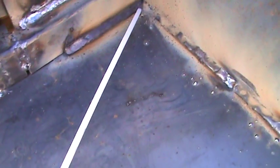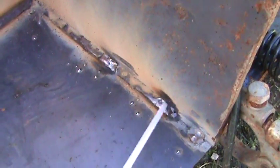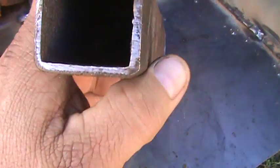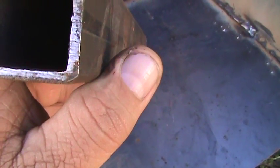As you can see, I've got a tack weld here, a little weld over here — back and forth. That's because you do not want to start on one end and just weld straight through, because you're going to warp the plate. So I clean the weld up, let it cool, come back and tie in, let that cool, jump around. I'm staying up on the high side, making it tie in, because I'm using square tubing. As you look at the end of this, I'm welding to this piece where my thumb's at — you see that corner and how much thicker it is, so I'm less apt to burn a hole in it.